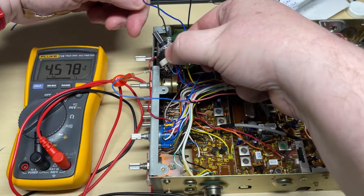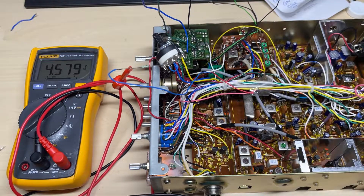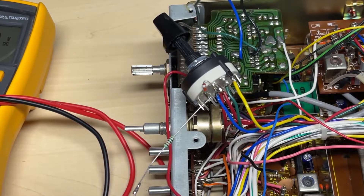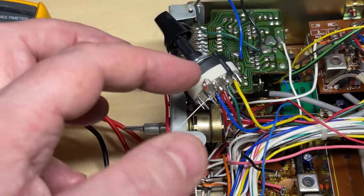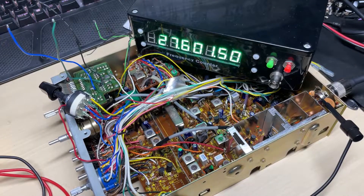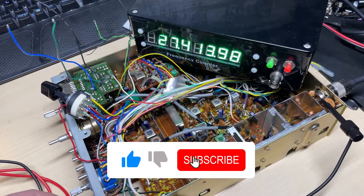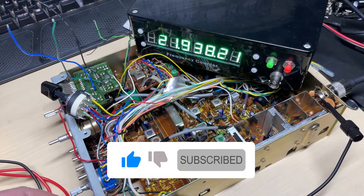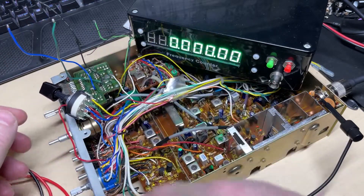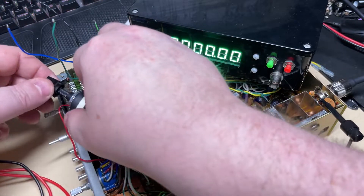What I've done is put a 10k resistor in line with the power, which has brought the voltage down to four and a half volts — enough for the PIC and to stop it interfering with the high. To enable the high as well, we've dropped a diode in place which isolates it when it's on UK40 but still powers the high band. As you can see, the band select works nicely.